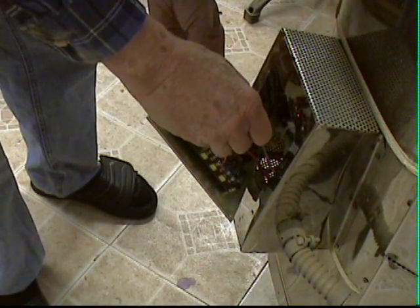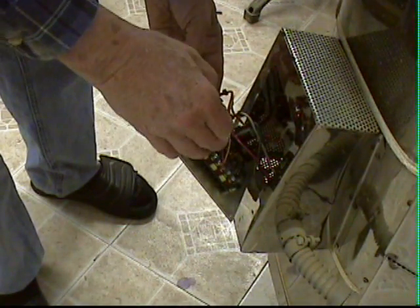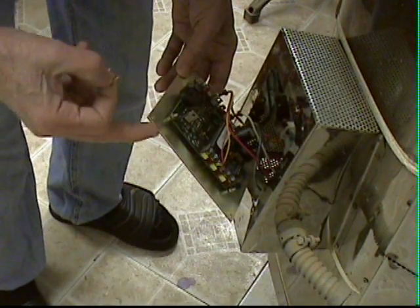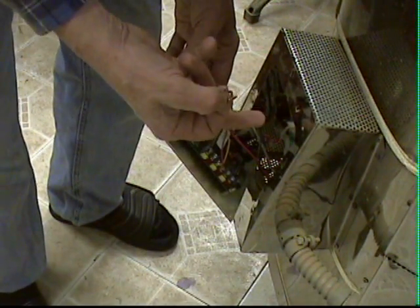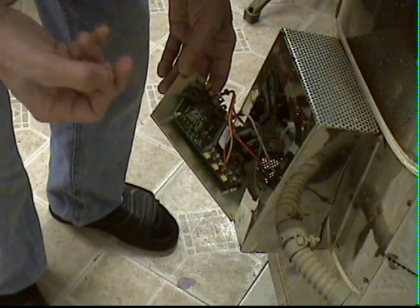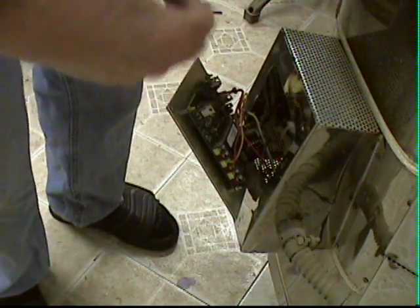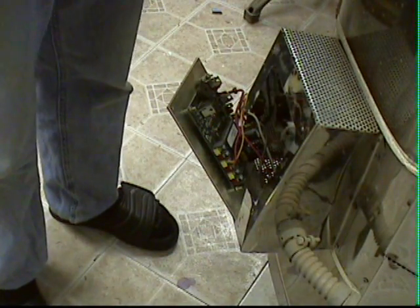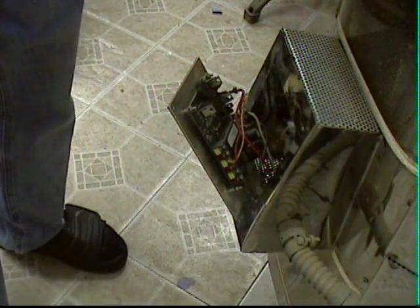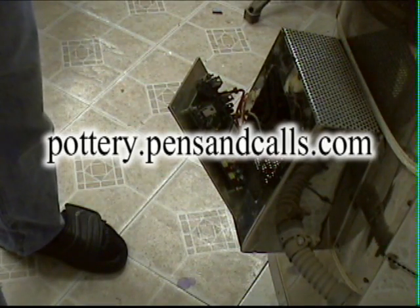Right from Olympic, this cost me $45 for the new thermocouple. It was actually larger in diameter than the original, so I had to drill through the fire brick and open the hole up slightly so the new one would slide in. I wired it back up, put it back together, and it worked — no problem. So that's what you do if your Bartlett controller says 'FAIL.' I hope that helped somebody.